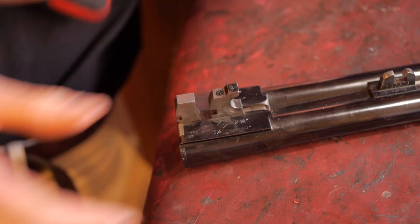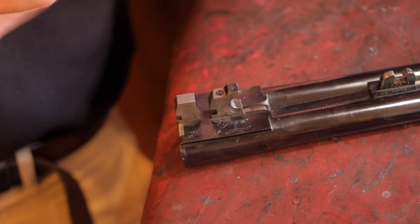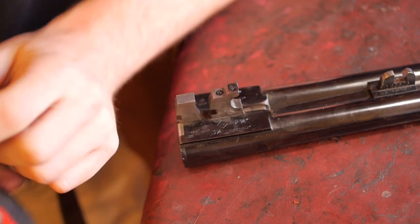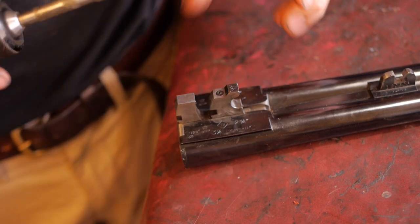Welcome to the gun shop. Today we're going to be looking at side-by-side ejectors. We have a Webley 700 here that runs off of Southgate style ejectors. To take them out it's really simple — you need one tool, and that is a correctly sized turn screw or screwdriver. If you don't have one, grind one to fit and keep it; it's fairly invaluable.